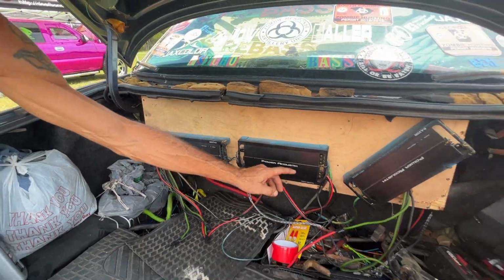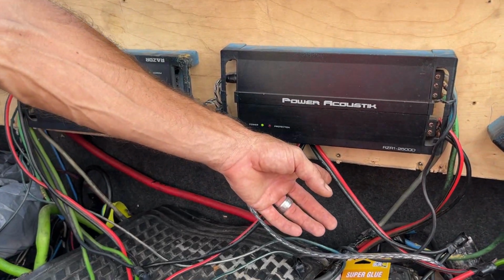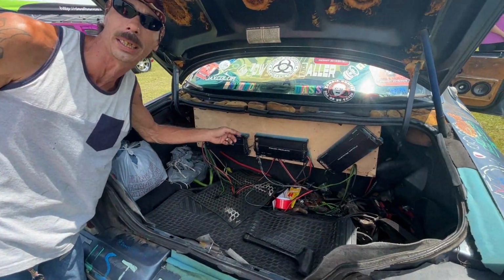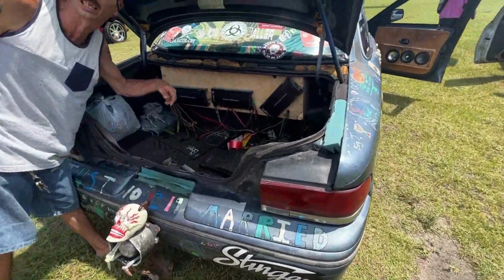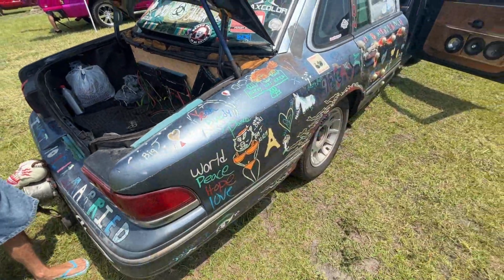And this is one side of the 18 at 2 ohm. And this one is the other side of the 18 at 2 ohm. Each 15 is one and one, wired up to 4 ohms, so it brings it back down to 2 ohm when you hook it up. Negative. So it kind of keeps it at a stable 2. Is everything still phased right?